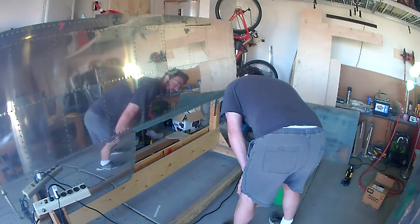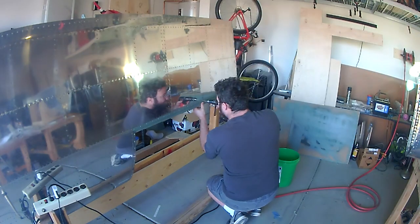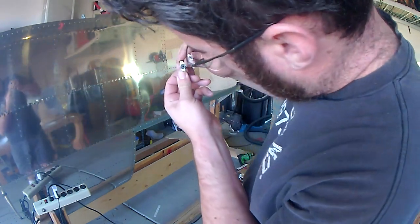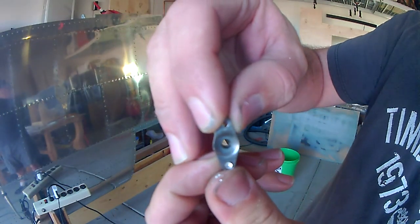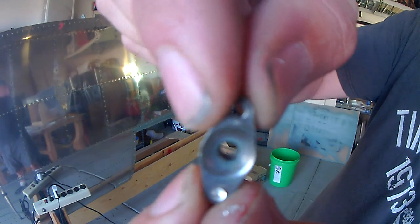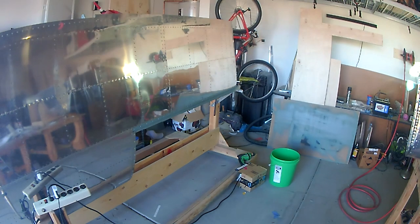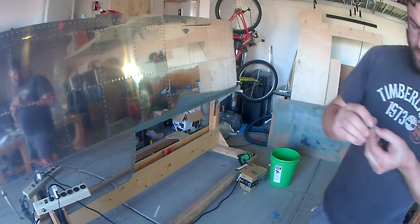The nut plates are driven into the spar, so I'm taking a look to see what's causing the problem. You can see me carefully drilling it out here, and then we found the problem. I'm trying to get the camera to show into the innards of that nut plate, but there are no threads whatsoever on the inside of that nut plate — that's why the screw just would not go in. I went through and found a replacement, and this is what it's supposed to look like.